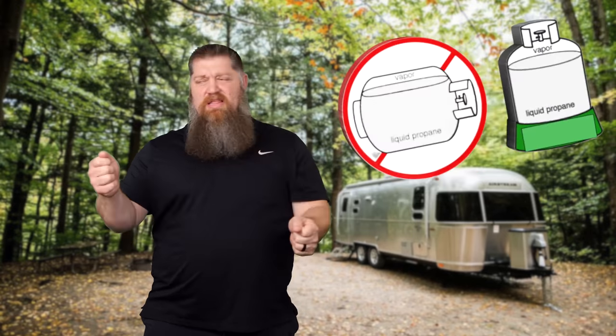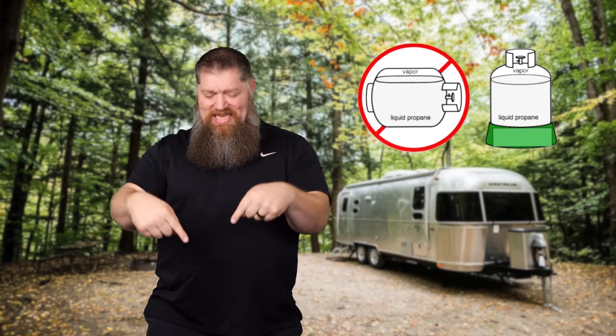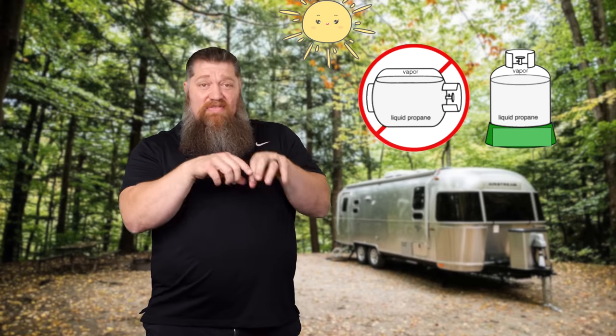Cylinder. All right, because of the high-pressure relief valve sitting up top, the dip tube sticking in about 20%, the dip tube's nothing but a straw. What we want to actually vacate if there's too much pressure built up is the vapors. Now, propane, we're transporting it as a liquid. And when it's a liquid, it's 270 times more potent than a vapor. And when we lay it on the side, if there's too much pressure from the heat, direct sunlight or whatnot, that overpressure valve releases. If the dip tube is actually in the liquid propane, then you're going to get 270 times more propane out of that valve. So the DOT says put that in the upright position.